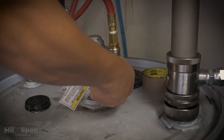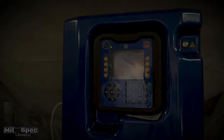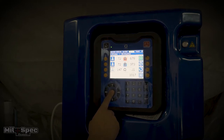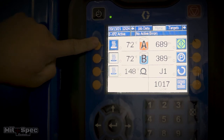Come over here and turn off our air agitator. I do like to go ahead and unhook the hose at that point, just to have it done and unplugged. At that point we're going to start warming our barrels up with a recirculation process. Come back over to the machine, go ahead and turn on your screen, and hit your A and your B temperatures. You'll see the little light will be flashing, which means your heaters are engaged.